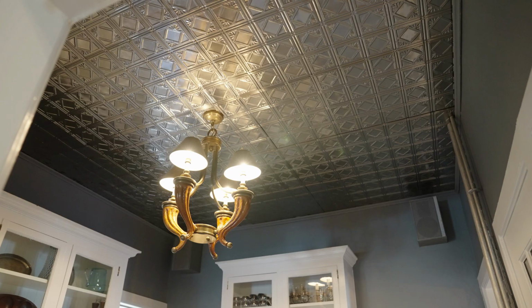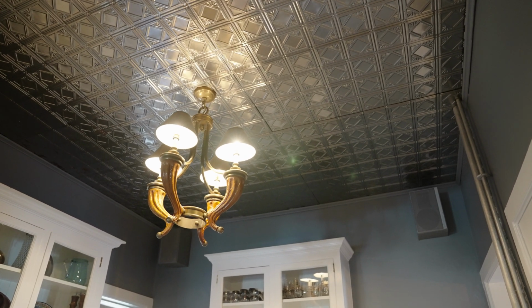And what you're doing is you're activating the old lime from 1930, and then you're putting new plaster into the hole, and the two surfaces marry into one wall again. And the moment that happens, it is no longer a repair, it is a solid piece of ceiling.